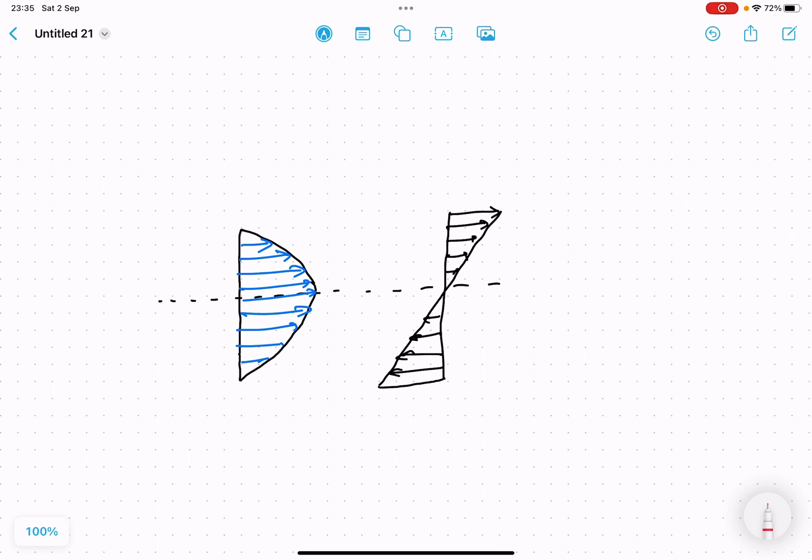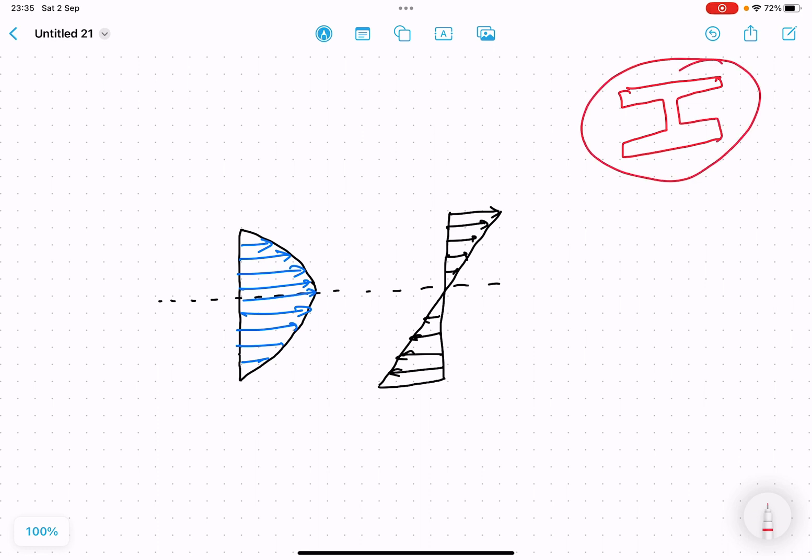First, if you know about the I-section — the splice joint is usually used for I-sections or box sections, and even the box section is made up of the I. Now, in this I-section, if you have the fundamentals, the major shear portion is carried by the web. The connection between the I-sections is the flange. The major shear stresses are taken care of by the web.